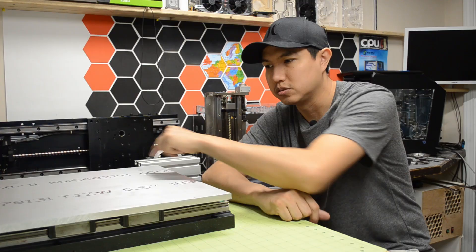I think this test has a lot of epoxy. On this other test I actually did 75% sand and 25% epoxy, but that ratio is by volume. Believe it or not, there is less epoxy here than there, and both pieces turned out to be really good — they're both really hard. I can actually measure the strength between the two. I'm going to be filling all the extrusions with this ratio, since you can actually compress it. What you want when doing epoxy granite is all your sand or gravel to be packed as tight as possible, one next to another.